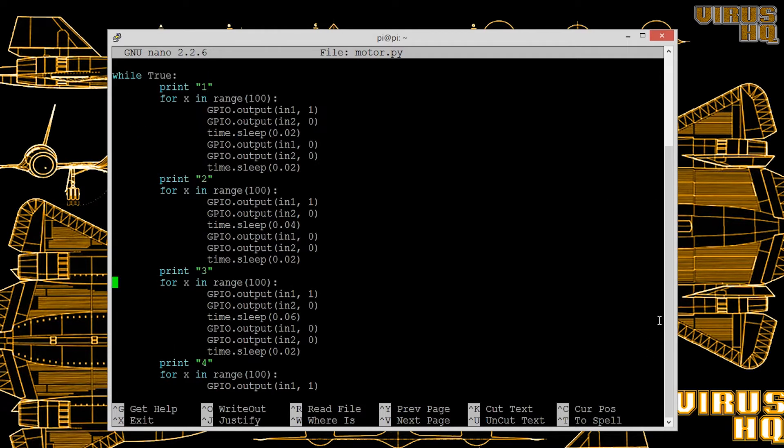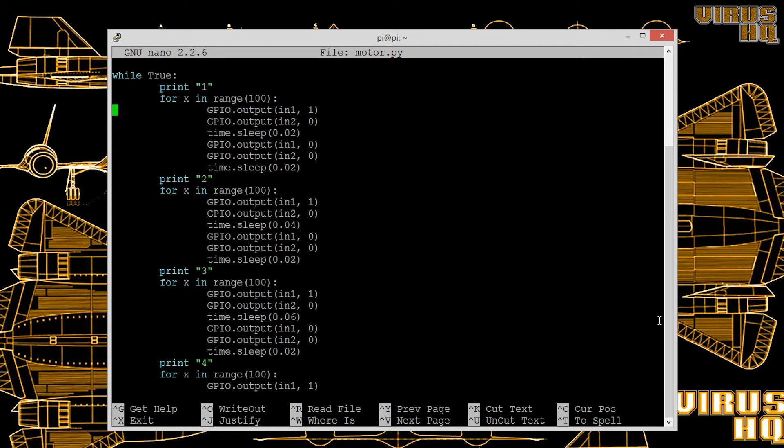In the while loop I added four loops for changing the speed. One of the good features of controlling a DC motor is PWM. The three ways to control the speed of a motor are: limiting the current, limiting the voltage, or changing the PWM cycle. In the case of the L293D, changing the voltage or current is not practical because you would need to add an extra circuit to the input side, so using PWM is quite simple.